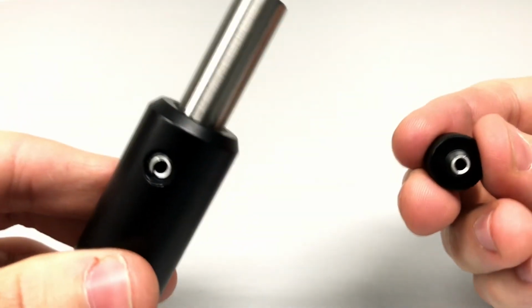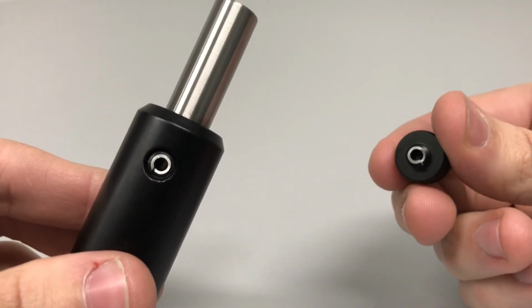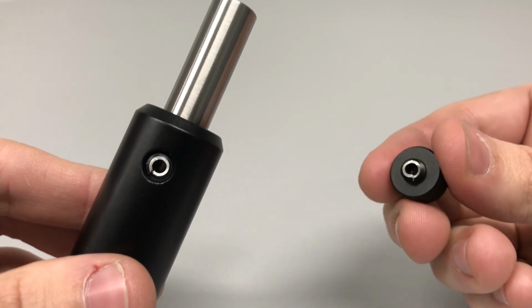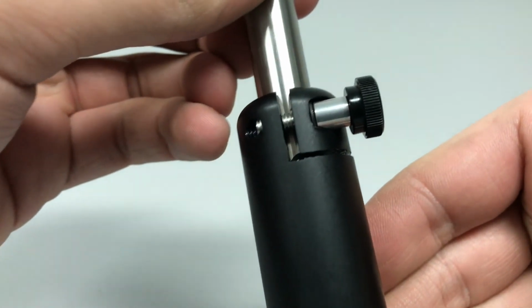Lastly, a common flaw found in competitive post holders is a weak thumb screw. Here's an example of how too much torque can ruin a post holder that has a screw in contact with the post. When using a hex key to secure the post in the post holder, the top of the thumb screw has a tendency to break off. Spacelab Tools thumb screws do not suffer this weakness by design, and the post holder design further eliminates the need to overdrive the thumb screw.